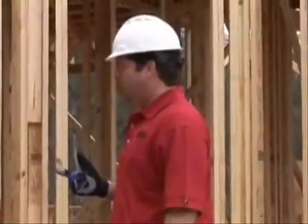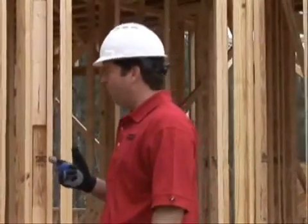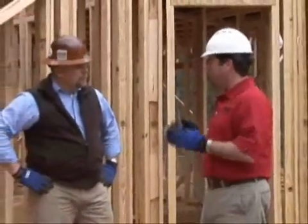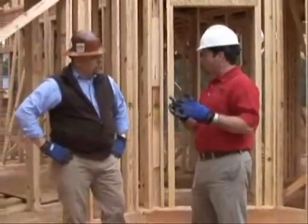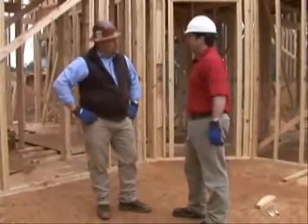Fortunately, with this product, you're already accustomed to using I-joist. We have one rule in I-joist: you must be two times the diameter of the largest hole away from it before you cut the next hole. So in this case, cut your hole — if you cut a four-inch hole, I need you to be eight inches away from that four-inch hole before you cut the next four-inch hole.